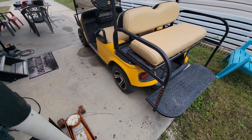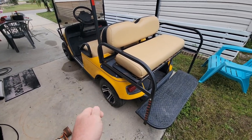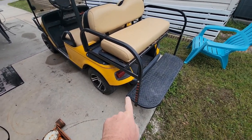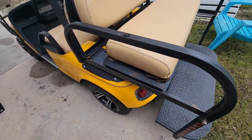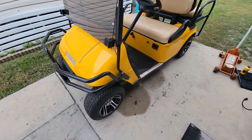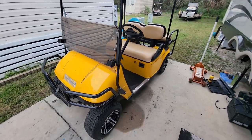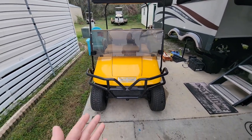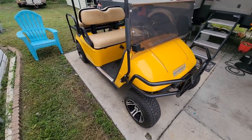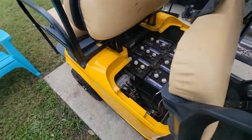The only other things I need to do: a little wiring repair for the lights, and the light switch itself burned out — checked it with 12 volts, no continuity, so that switch is bad. I also want to change the rear end fluid because that rear end is definitely full of water from being submerged — it most likely has a little vent tube on top. All in, I picked it up for $500 from a friend at the campground and got all the used equipment for $175.